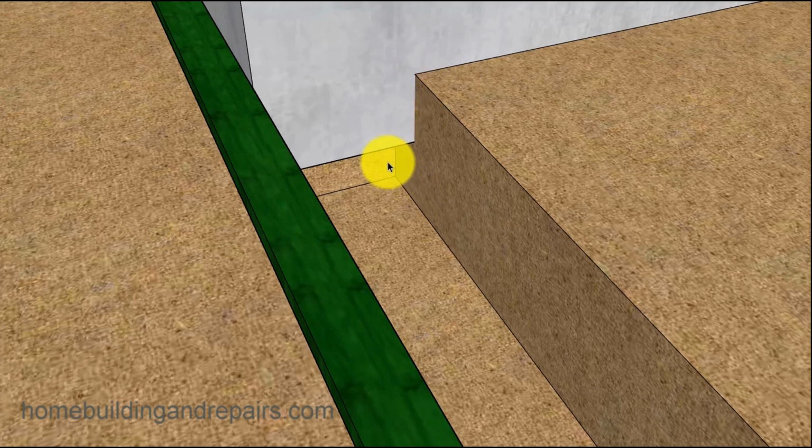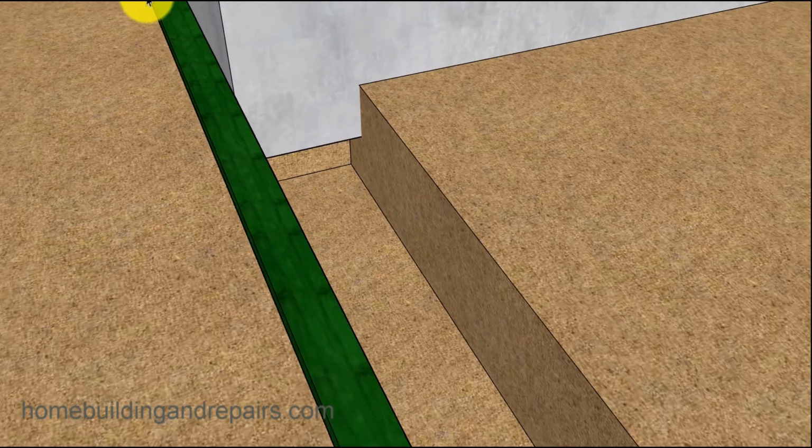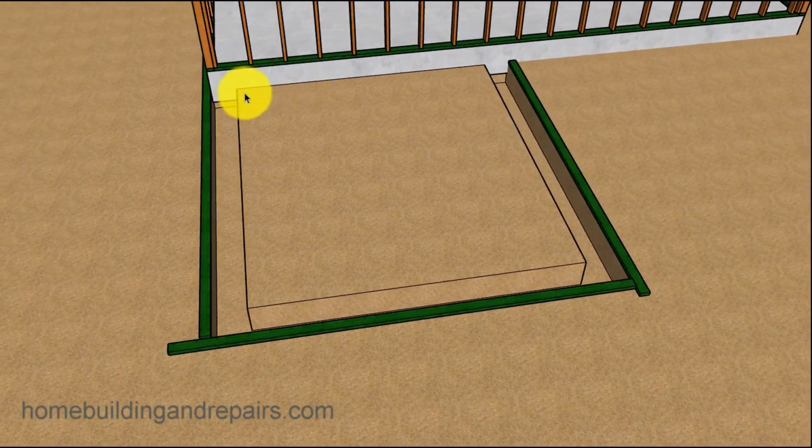I also like to dig a little bit underneath the existing footing if it works out that way. If the existing footing is below the new footing, I don't worry about it. I'll let the epoxy rebars handle everything. So if that's the case, this just gives it a little key. That's what we used to call it. I don't know if they still call it that. Maybe you guys can let us know what you call it. Leave a comment in the comment area.